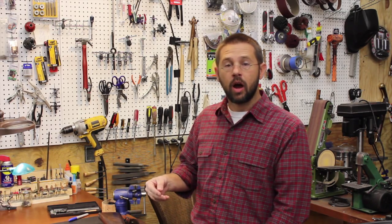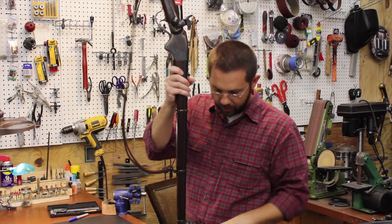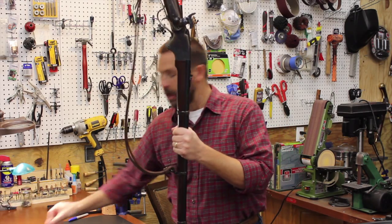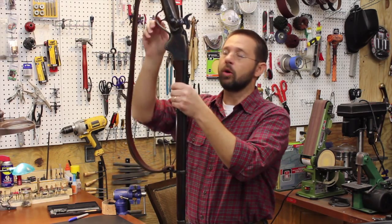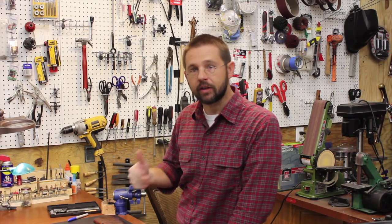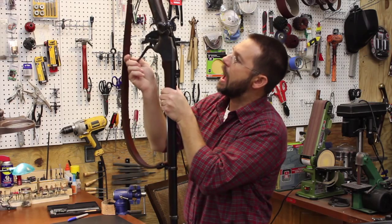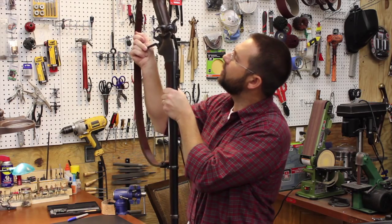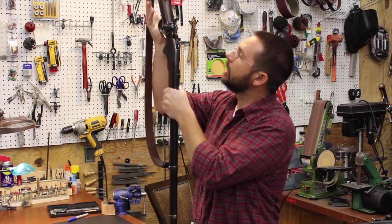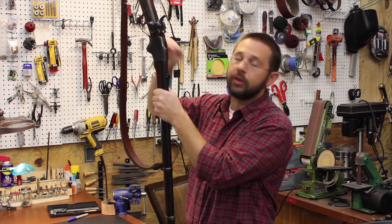There's an easy way to check whether you need to do any work on your cartridge guide or to check your progress. Put the breech block back in the rifle and cycle a round through just gravity-fed: remove the rear magazine tube, set the rifle muzzle-down on your workbench, stick a blank cartridge right in the magazine, and work the action. It should cycle right in with no trouble. If the cartridge hangs up, do it again slowly and watch right in the breech to see if it hangs up anywhere. That should tell you whether the front or rear of the cartridge guide needs to be filed down.